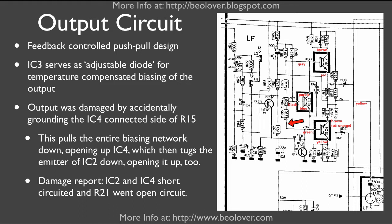This actually led to some confusion when I replaced the Darlingtons, and I then had to realize it still didn't work. The way I noticed it is that when this here is open circuit and these two Darlingtons are in good shape, you get about 40 volts at the base of the NPN Darlington. That made me think I should maybe also replace this transistor, because it's only rated to 35 volts.